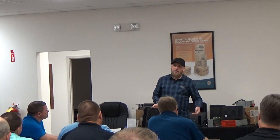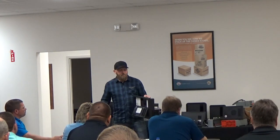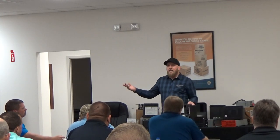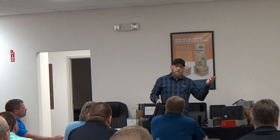I mean, I guess you can, but for high voltage, you can get surge protectors. Anytime I talk to a customer, I recommend one. We don't sell surge protectors, so I'm giving someone else some business, but surge protectors are going to protect your converter and everything else on your AC circuits. Think about it: you're in a campground with 200 trailers, and through the day they're all running their AC units. At 7 o'clock at night it starts cooling down and everyone starts shutting down their AC units. Most likely that voltage in the campground is going to spike.